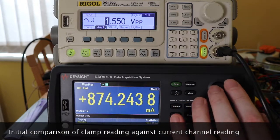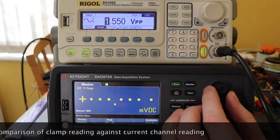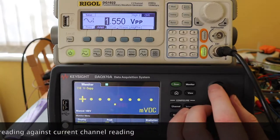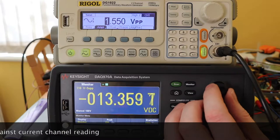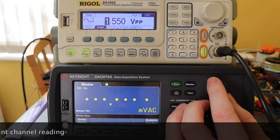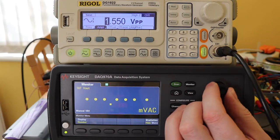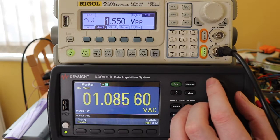There's a bit of difference between those two. Volts positive: 13 volts. V-minus: minus 13 volts. V-in should be 0.5, should be about 1 volt.